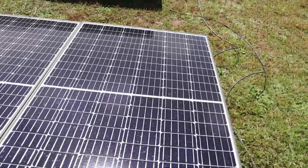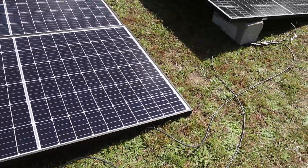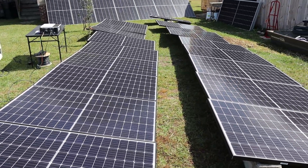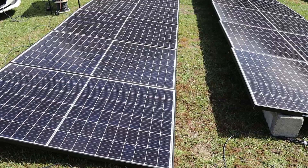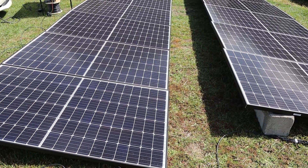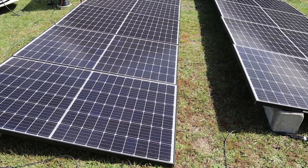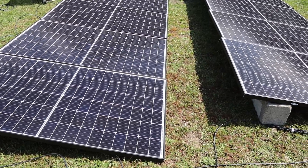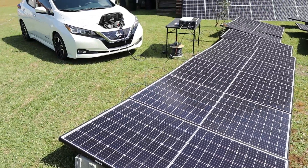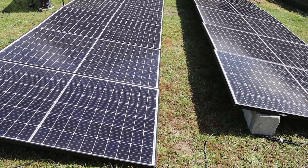We should definitely have enough watts to run it right now. What I'll do is take this array and hook it up to a different inverter — my inverter that has the battery on it — so we can see exactly what this array is making. If it's not making the 3,600 watts we need, we can wait until later in the day when it might be making the right wattage to charge the car, and we'll try it again.